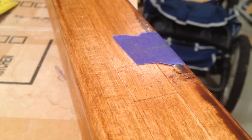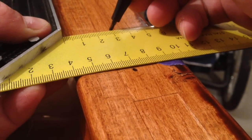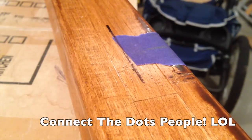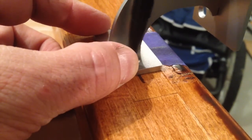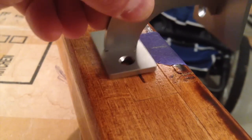Let's look at how I'm marking these. The bracket width is about 6 centimeters, so I put a mark at 3 centimeters on each side and connect them with a straight line through the middle. That's the line where the bracket has to fit, and as long as the line is through the middle I know exactly where to drill. Now I've got two clear marks showing where the drill holes are going to go for mounting.